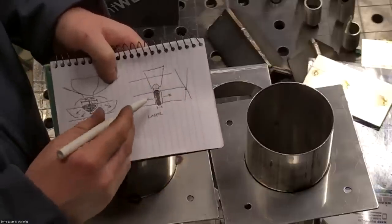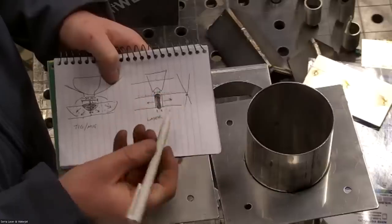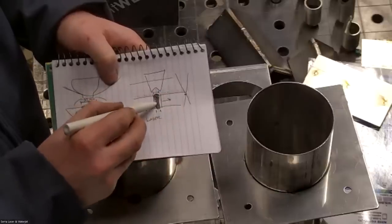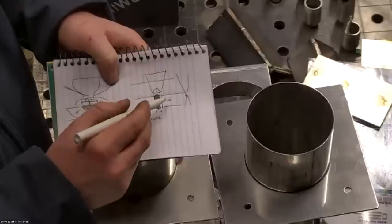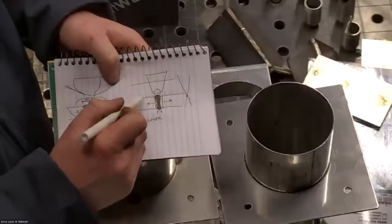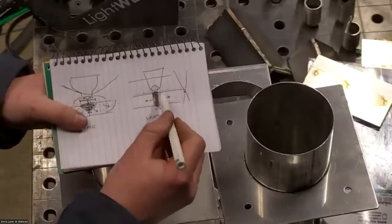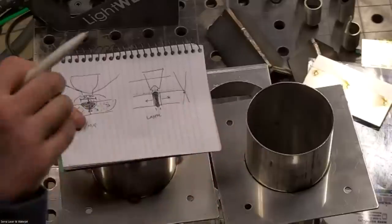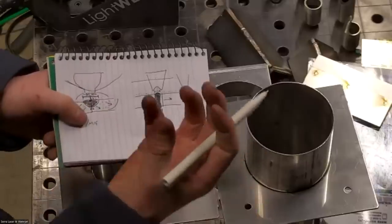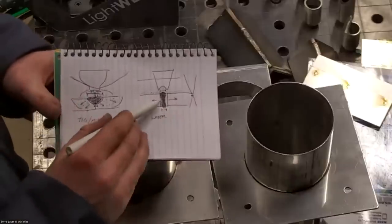so the material doesn't warp as much, it stays nice and flat. But yeah, so the surface contaminants, you don't really need to worry about the material being perfectly clean because we're actually welding from in here. The very top surface might be affected by the cleanliness, but your weld is not going to be affected. A lot of times if I see contaminants on the top surface after the weld, I end up seeing it on top of the weld, like we've gone underneath and kind of welded from below. So it's really interesting.